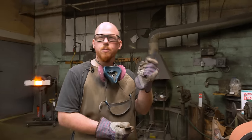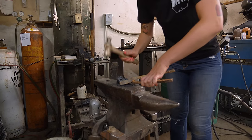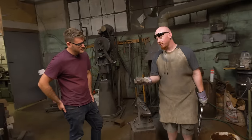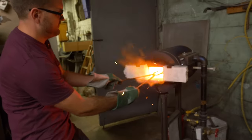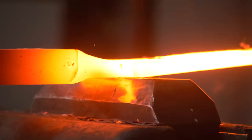The bloom looked to be much more on the iron side of things. We debated whether to start hacking some pieces apart to find hard pieces and separate out the porosity. This chunk isn't breaking at all and looks reasonably easy to just start flattening. Forge welding is weirdly easy — it's just everything else you need to do. You're managing a forge, watching the temperature. Get it hot and eventually it'll stick together when you hit it hard enough.